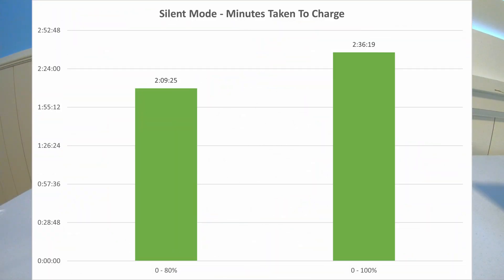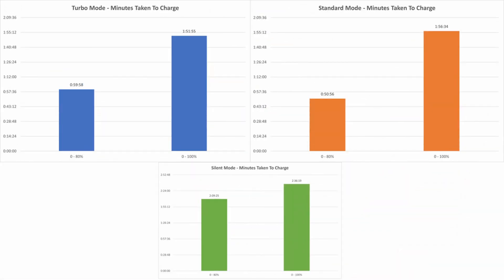Silent mode, as you'd expect, takes the longest. However, notice that the differential between when it gets to 80% and 100% is substantially smaller. So I would certainly keep your power station on silent or standard mode for normal everyday charging. When you really need to juice it fast and you're really low but not interested in filling it all the way up, that's probably where turbo would come in. But aside from that, I'd steer clear of turbo — not only due to wear and tear on the battery and the unit, but because I don't see a huge benefit. Hopefully you enjoyed this video — please like and subscribe, and we'll catch you next time!